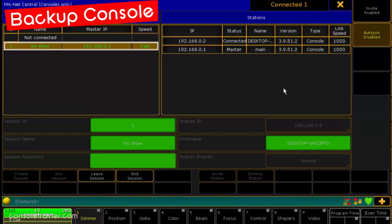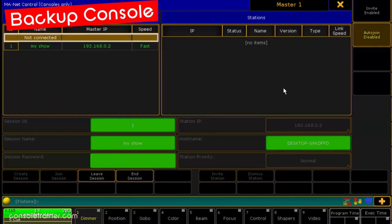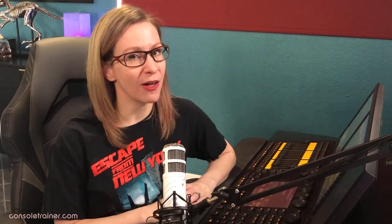So what does it look like if we lose a console during a show? I'm just going to unplug the ethernet coming from my main console, and when my backup notices the main is gone, it'll take over as master. It's not instantaneous, but it's pretty quick. Because I was logged in as the same user on both stations, my backup is on the same page and in the same queue as what was my main, so I can just walk over and start running the show from the backup. If your lights are connected to NPUs, they're still in session and still outputting. If you've got other physical connections like ArtNet, those will now have swapped to the backup as well. And if you're using physical 5-pin DMX out of the back of the console, now is the time to switch that A-B switch to the backup desk.